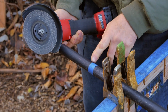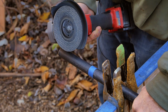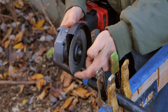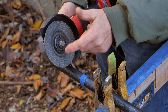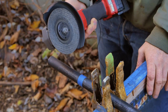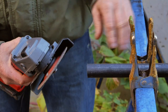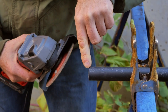Next I'm going to cut this pipe to length. I mark it with a piece of tape because I get better results that way. I've got it braced between a couple of clamps so I can still rotate the pipe during the cut, but it won't kick off angle — the danger with an angle grinder is if it gets deep into the pipe and twists, the wheel can shatter, which is a really dangerous situation. I'm assuming you're already trained in the safe use of this tool. After the cut, I like to break the sharp edge by holding the angle grinder at an angle and rotating the pipe to give it a nice chamfered edge.